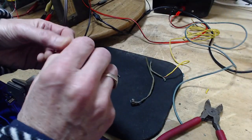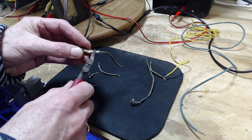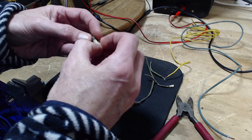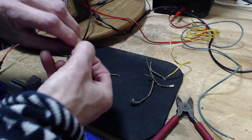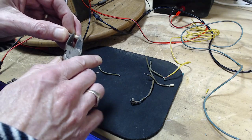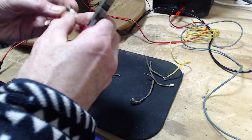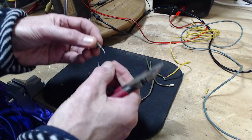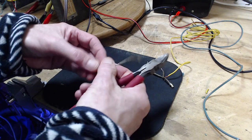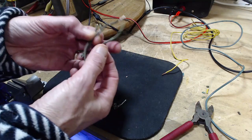What was somebody trying to do here? No advantage to doing this. What would prompt someone to do this? It's possible this connection is poor. This is not the one from the local oscillator, though. Because it's just a compression in here. And, you know, it could get loose, and maybe somebody discovered wiggling this does something. Feels great to me. Feels perfectly fine to me, but... Or they just didn't like the look of the bare wire, which is probably really the problem. Goodbye, green wire. Green wire everywhere.